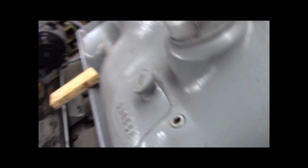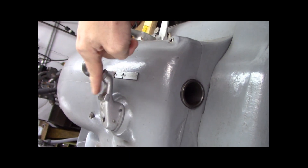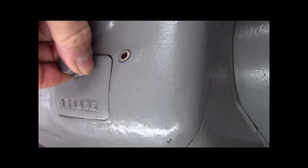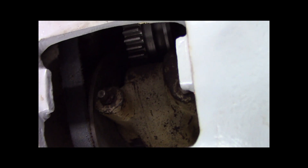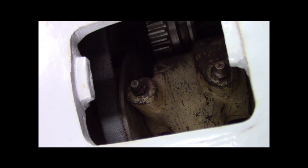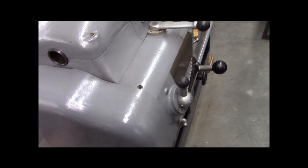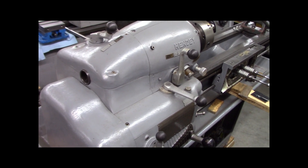Let me show you a Christmas tree. See that casting? It says 'grease' - this is for the power feed gear. You loosen that up, take it off, and down in there are more zerk fittings. Based on the fact that it says grease there, that's another clue that this is supposed to have grease. But I'm going to keep that high pressure injection gun and use it for the fittings on this lathe with that motor honey stuff.